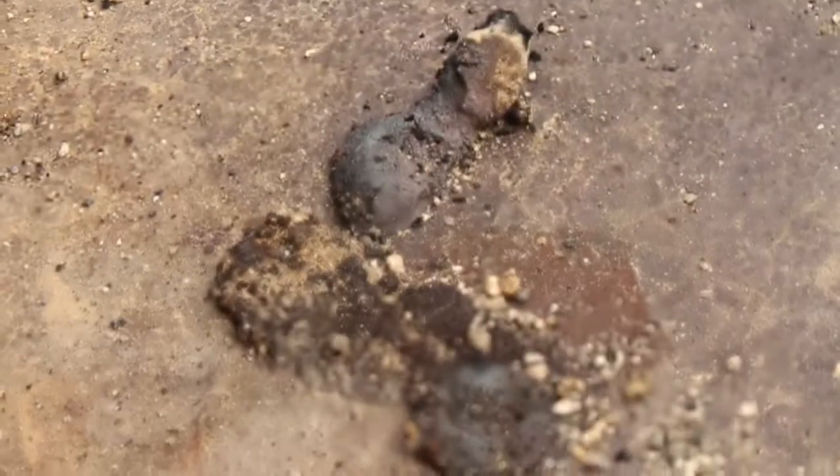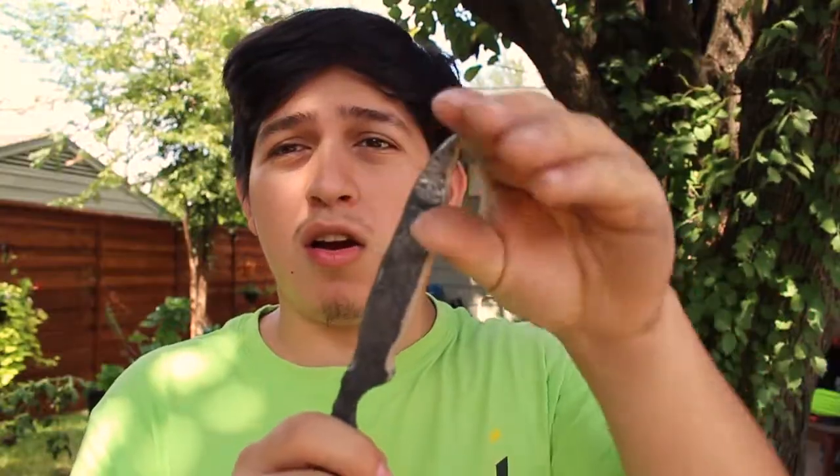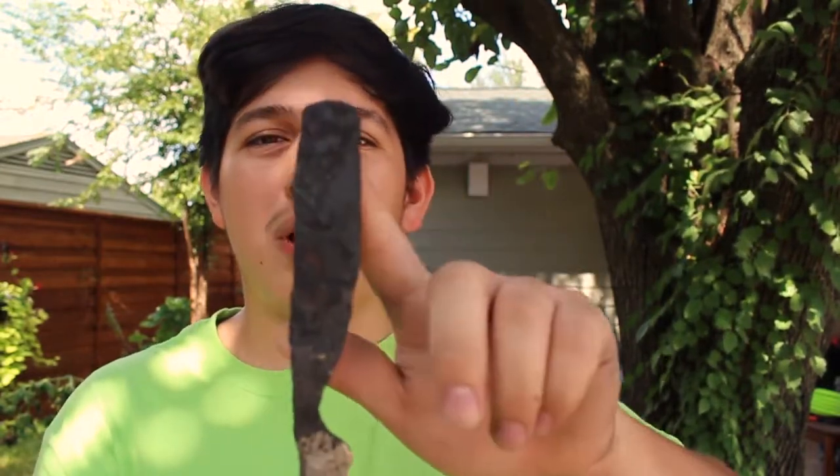Now we have this little blade. What I'm going to do is bend it back into place, and then I want to curve it to make it like a curved little claw-shaped thing. This is what I was able to do successfully — make the tang. It's not going to be this fat; I just want extra material to work with that I can sand down. When I went for the quench, I didn't have anything to hold it down, and I put it into water, which is a no-no. You can use water but it's harsher than oil. I put it in water out of desperation, just trying to let it cool down a little bit for a safer quench, and it worked.